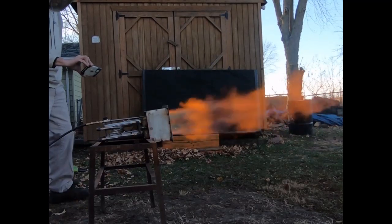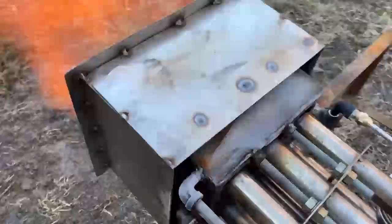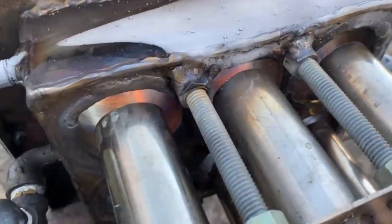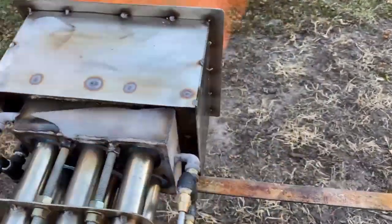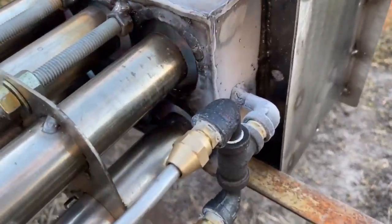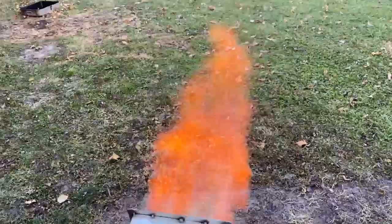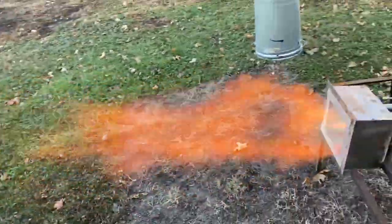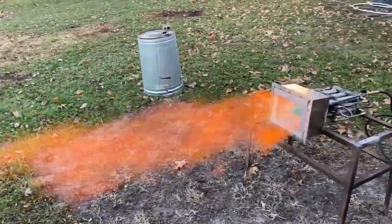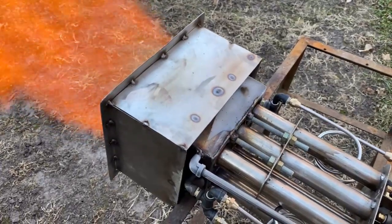I'm very happy with how well it ran. I've got some highlights and close-ups to check out. Isn't it crazy how just 5 millimeters of movement on those Venturi barrels caused that much of a difference in the flame profile? The vaporizer box is being put to work — that thing is just barely doing its job there. But this thing is going to a desert in India, and it's going to be like 120 degrees on a cold day. So I don't think we're going to see any frost on this thing when it's put to work in India.